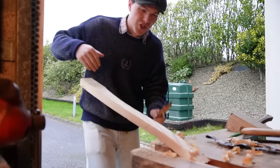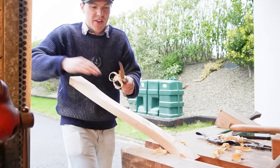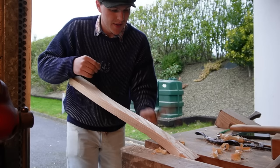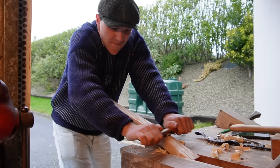So even though we have it shaped out, it's still much too thick. So we're back here with the spokeshave, just taking as wide a shaving as we can to thin down this side, and then once we're happy we can come along and do the other side. When these spokeshaves get clogged, they're very easy to fix — a lot easier than the metal ones.